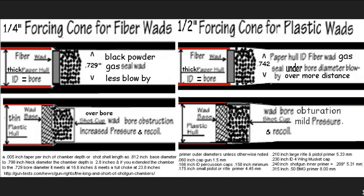Here's something interesting: if you continued the 5 thousandths-per-inch chamber taper until it reached the bore diameter of .729 inches, you'd end up with a barrel that's 16.6 inches long — just about an inch and a half too short to be the legal minimum length for a shotgun. Kind of funny. But if you made it a full-choke taper — not multi-bore, just a tapered piece of pipe — it would end up being 23.8 inches long, plenty for a standard gun. Would this work? Only with modern thin-walled shells and fast-burning powder — I want to do that experiment.